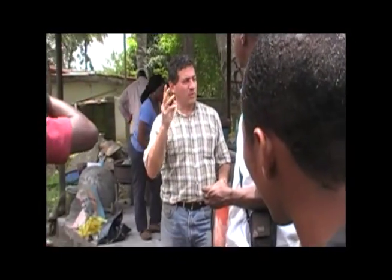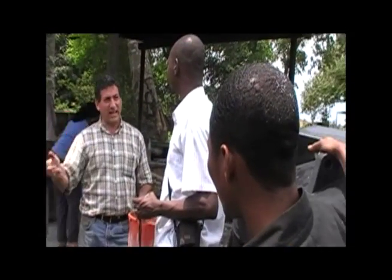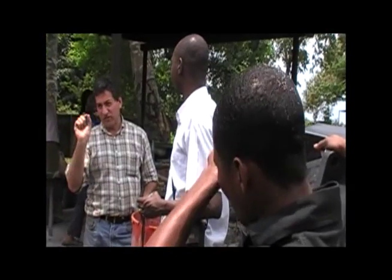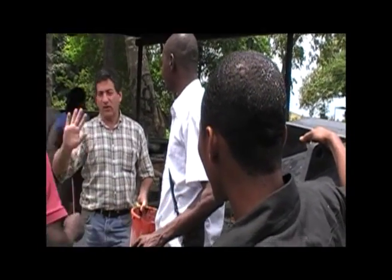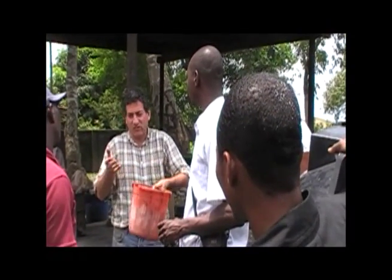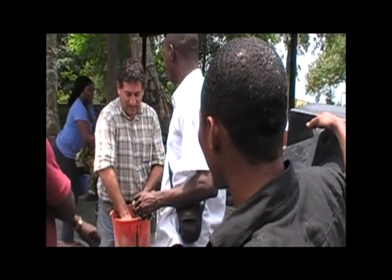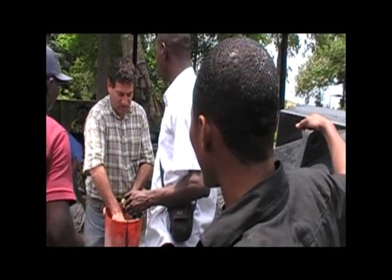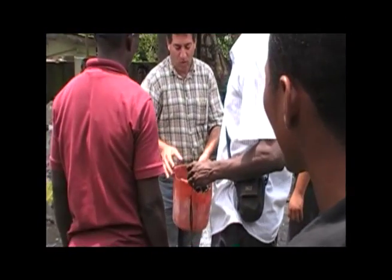When we put the bacteria in today, it will take 3 weeks from now until you're getting gas. And when you see the first gas the first day, you don't feed for 3 weeks. You say, okay, sit there and get comfortable. Then it begins to produce gas. You say, okay, I'm going to give you a little bit, maybe this much food waste. Then the next day, this much. Then this much. You can go up to this rim here, but if you do more than that every day, it will overflow.